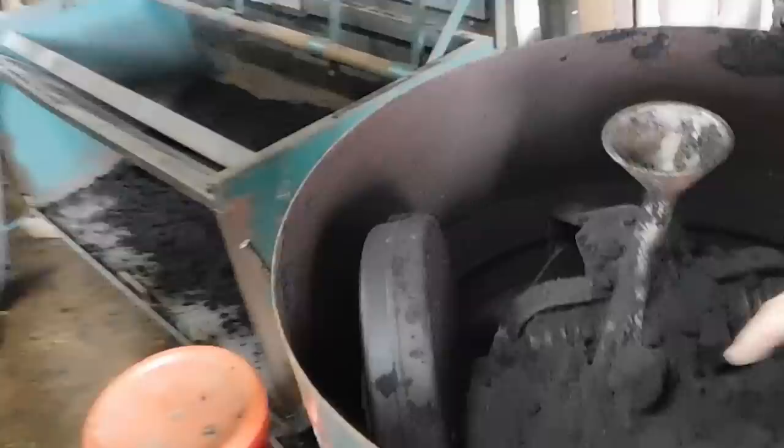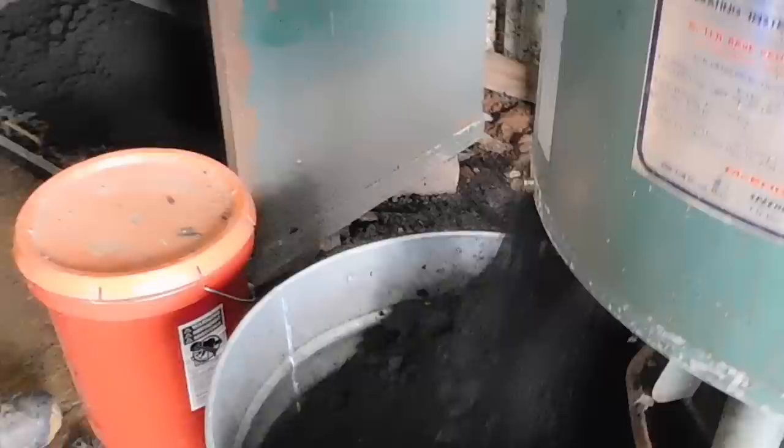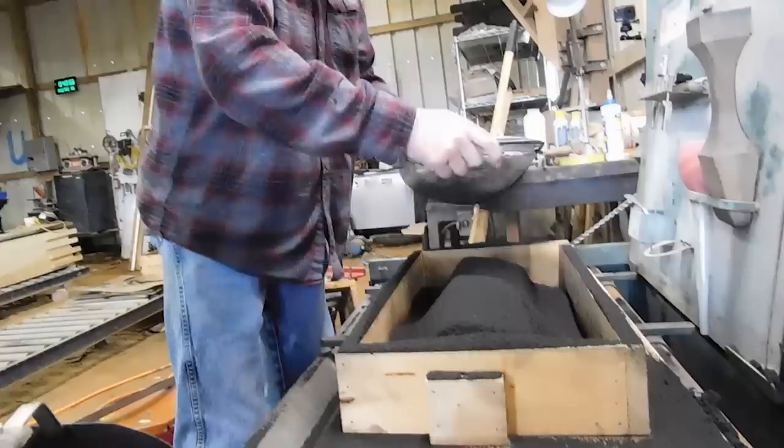Clarke and the Windy Hill Foundry use a clay-bonded green sand that is activated when water is added to it. If you've been watching my videos, you know that my specialty is the resin-bonded sand. I have done Petrobond sand molds before at the Metal Museum in Memphis, and there were a lot of similarities between the Petrobond sand and this green sand, but there definitely were still some nuances that Clarke had to help me with. Thankfully, he's a great and kind teacher.